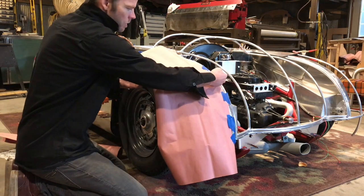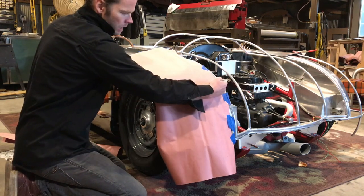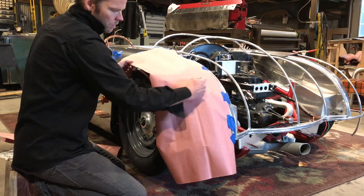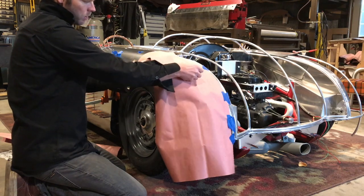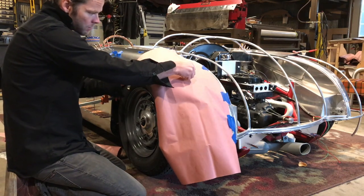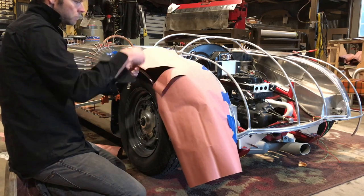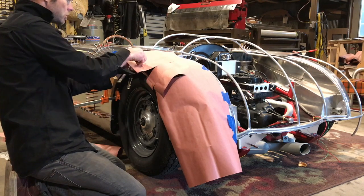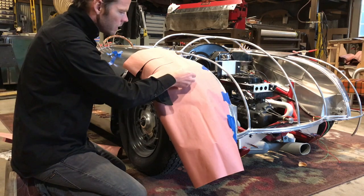Well, we're gonna kind of feel out where this panel has a slight arc right here, or a rise or a compound. So when I get to that peak is where I'm gonna start slicing, and I'll drop it into place here. I'm just slicing about every 3 inches to start with. Okay, now we see how that starts to lay down.